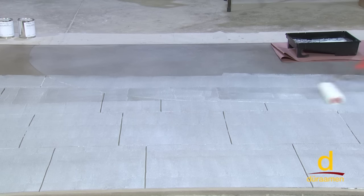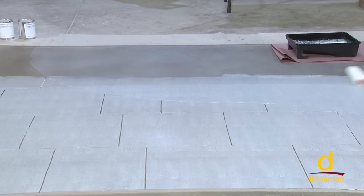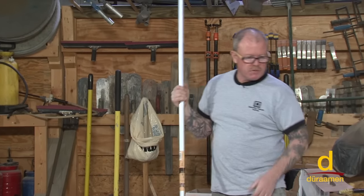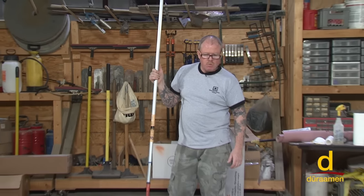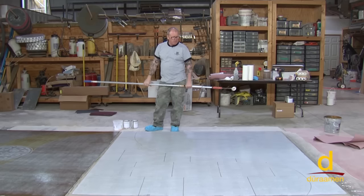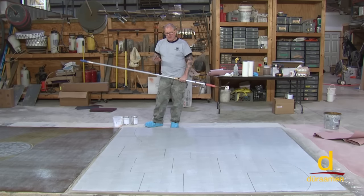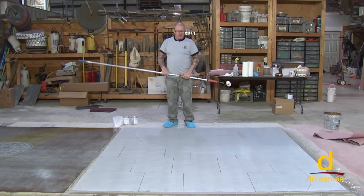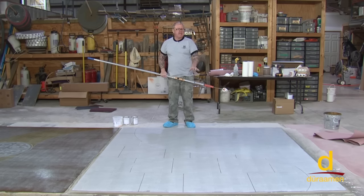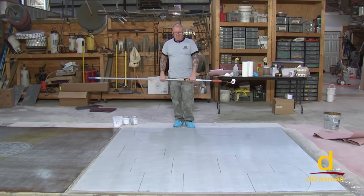We've just applied our E32 water-based epoxy to our PARAM 5500. You'll see kind of a whitish milky appearance, which is common on water-based products — that will usually clear up within about 45 minutes depending on site conditions. Also depending on the ambient and substrate temperature, typically you're recoating between two and three hours; it has to be tack free obviously because you've got to be back out on it. We'll give it another two to two-and-a-half hours and come back and put our final top and clear coats on it.